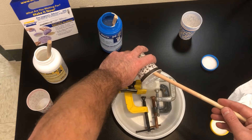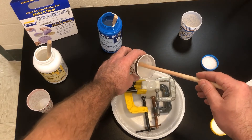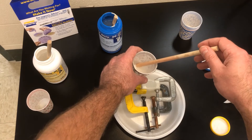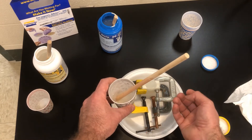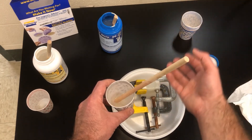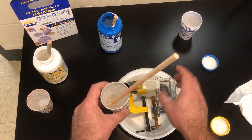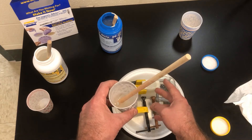You can see the way I designed my mold — I have a funnel shape at the top where I'm pouring in. That's called the sprue hole, and you want to make sure it's large enough. The funnel shape allows some excess material to sit there so that as this starts to settle and air works its way back up, there is a reservoir of material that can fill in any gap. I'm hoping we'll see a depression in the rubber there after it sets, which would show that air worked its way out.